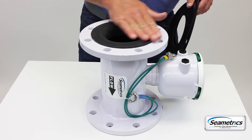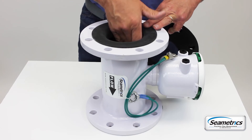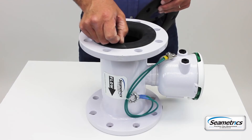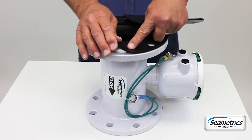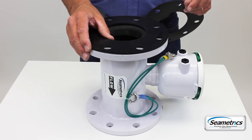Why do we install gaskets? This may look like a gasket, but it is not a gasket — it is a molded part of the liner. It's softer than the inside of the liner, about as soft as a gasket. If you install your meter without a gasket and bolt that flange on there, years later when you take the meter out, you can very likely tear the liner of the meter. Put a gasket on there, and if something tears, it's highly likely that you're going to tear the gasket and not the meter. So make sure that you install your meter with gaskets.